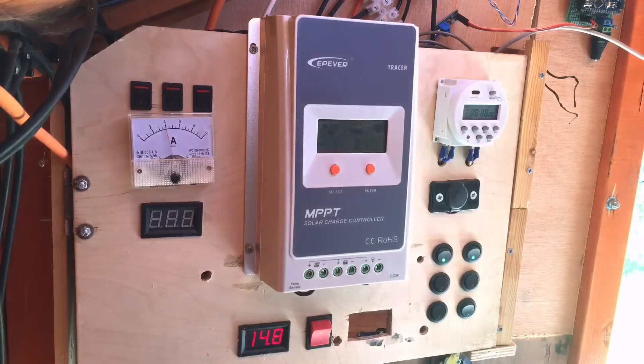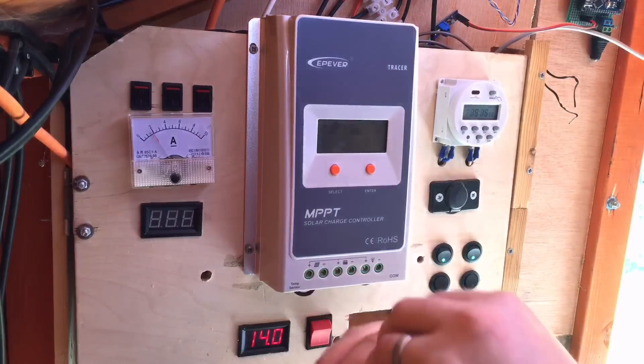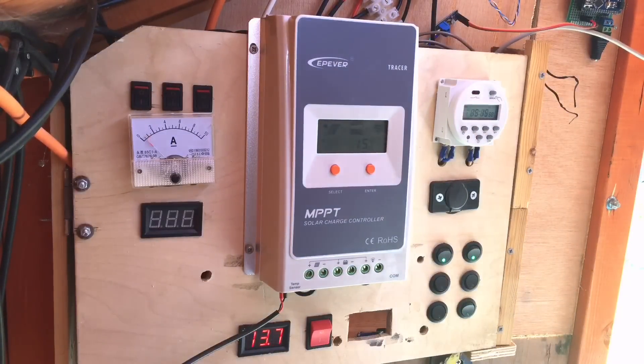The sun is coming out a little bit and the battery voltage is getting quite high. We'll be doing that absorb equalization charge to start with, and that shouldn't last for more than 30 minutes, which is what I've set up. The last thing I can do is plug in my battery temperature sensor into the bottom. The probe end is fed in between my two batteries.